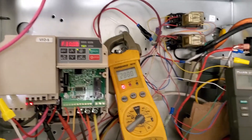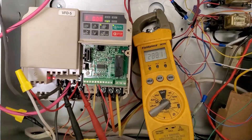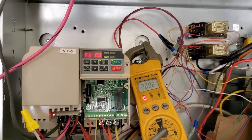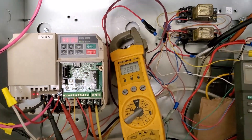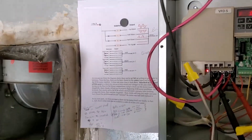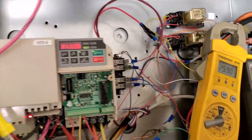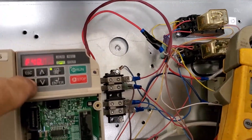This is a 2-ton compressor with head pressure probably at the more extreme. So I think with the 20 solar panels my voltage wouldn't be sagging at all — I'd probably be able to run a 3-ton compressor directly off it. My original plan with adding some solar in the backyard, making a gazebo out of it, would be to run a couple small room AC units like mini splits right off of it. I slowed down my blower which reduces some load on the compressor, got up to 40 hertz — and then it just tripped. I'm right at about 250 volts.